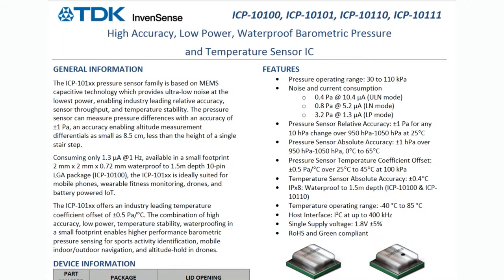Comparing this to sensors from 5 or 10 years ago, those were often only good for about a meter or so of altitude — again, not absolute but relative, so it could tell how high you're going up. Still, you're talking about a couple of microamps. It can go into quite a good deep sleep mode and get you high-quality altitude measurements and barometric pressure measurements that you can then convert into altitude measurements.